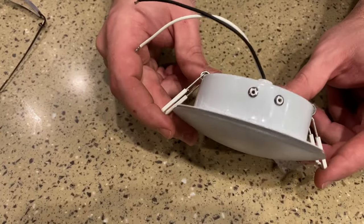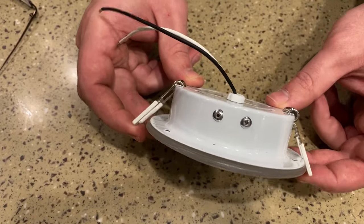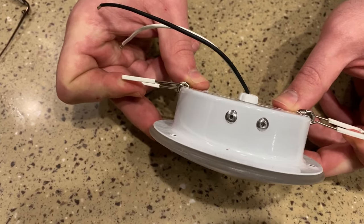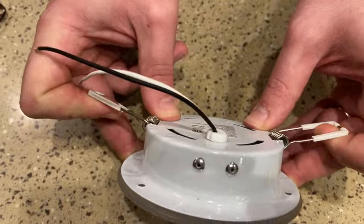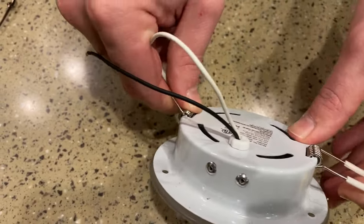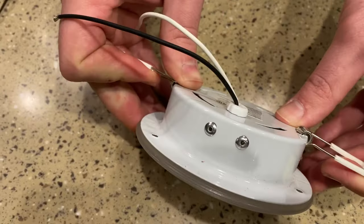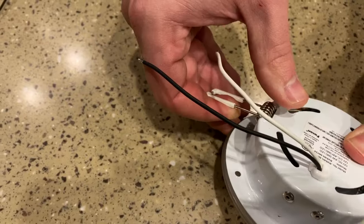You can see a more up-close view of the tension clips right here on each side — this is what holds it in. It's held in by a spring, and when it's in the wall it kind of looks like that. When you're pulling it out, it's a tight spring, so it's hyperextended. What you want to do is get one pulled down and kind of push up with it on your hand so you can slide that piece out and then pull the rest of it out.